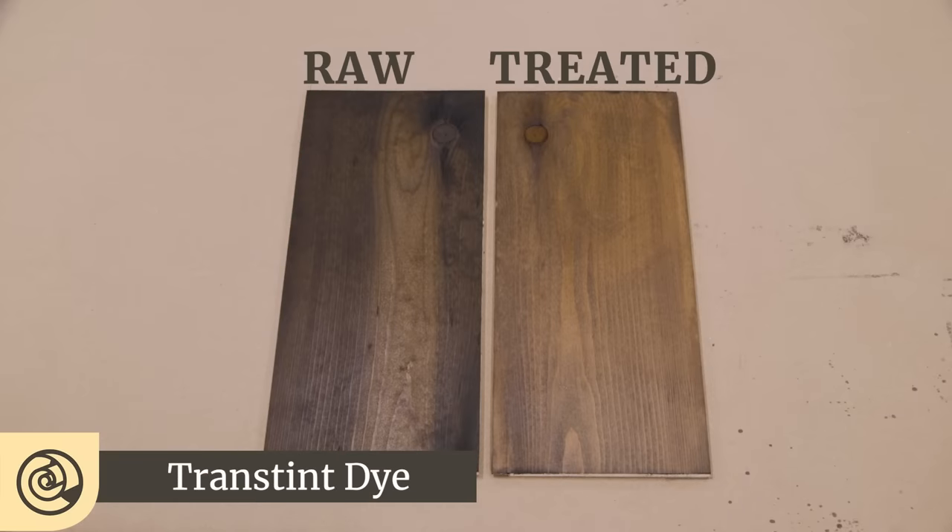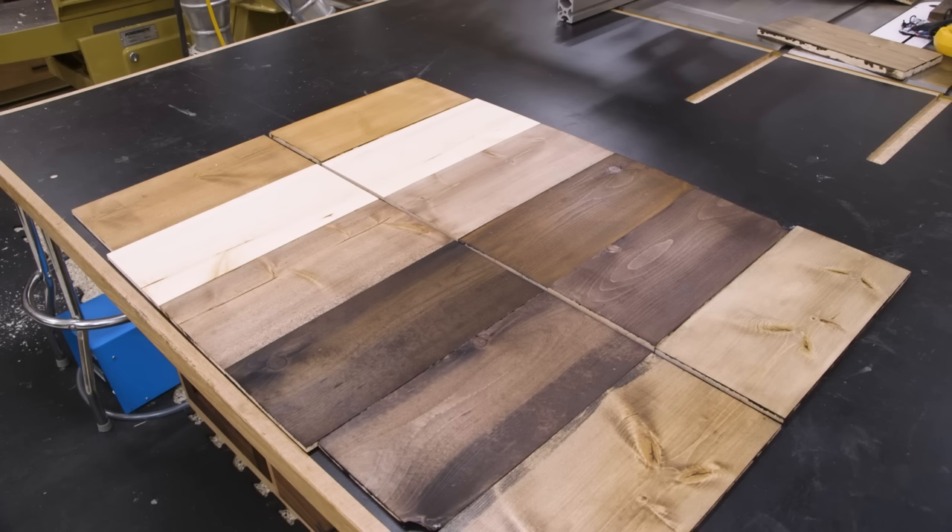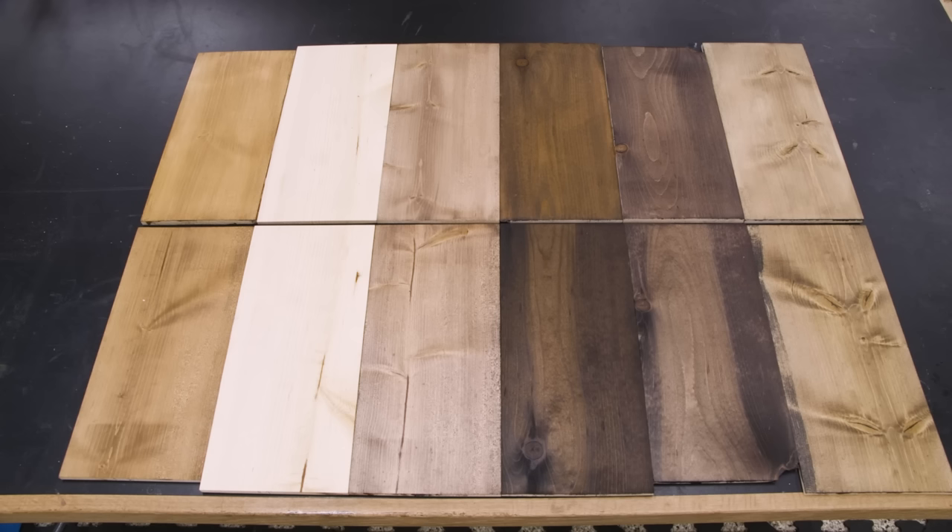For the water-based trans-tint dye, there's a really significant difference. Look at how the untreated board essentially has two dark areas bookending a lighter area in the middle. The treated board looks dramatically cleaner while not really sacrificing the desired color. For General Finishes dye stain — another surprise — the treated board looks better, no doubt, but not as good as I expected. By the way, this is where testing comes in. If you're doing this kind of work in your shop, test your finishing strategy on scrap first and adjust accordingly. On boards showing a little more blotch than I'd like, I'd probably increase the amount of glue in my mix and run another sample — finding the sweet spot between preventing blotch and preventing the color from penetrating. But looking at the boards on the whole, the top row just looks better and we haven't really sacrificed much in the way of desired color.